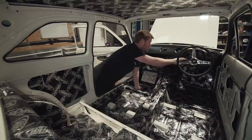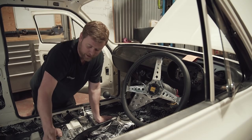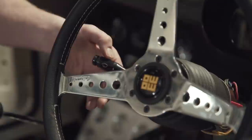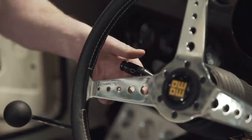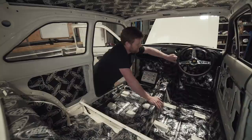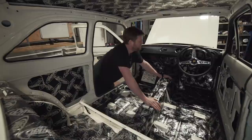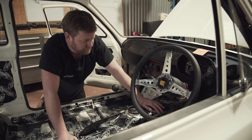While we're in here, the steering column is an Opel Manta steering column, which we chose for a couple of reasons: it's a collapsible column, which the original isn't, and the switchgear on it is just a single stalk. The look of this stalk is exactly what we wanted — kind of lean and purposeful. It covers a lot of functions on just one stalk: indicator, main beam, dip beam, half a pull is flash, then three-speed wipers — intermittent, slow, fast — and then push the end for screen wash. You've got the horn on the steering wheel.